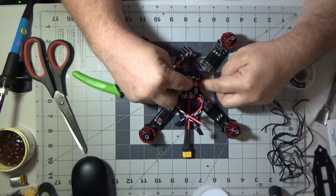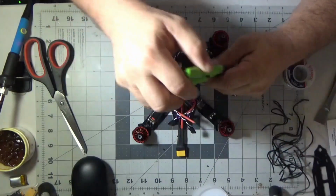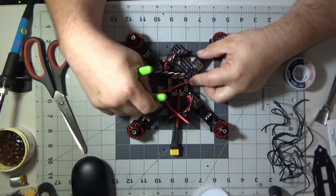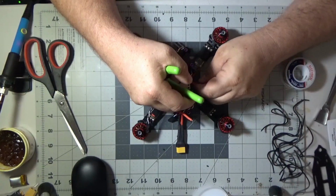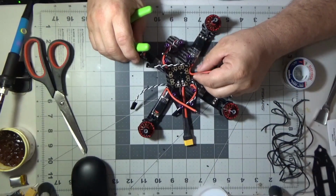But anyway, it turns the power up, and then that little video feed kind of goes away. I've got to figure out and make sure that's what it is, but I think it's low power, because the RunCam Hybrid is powered off the VTX, and when the VTX is in low power mode, I'm not so sure that it's delivering enough power to the video.